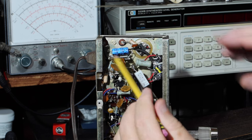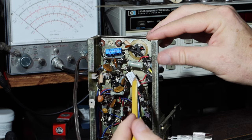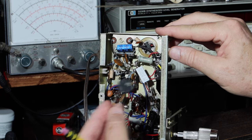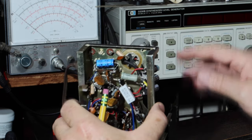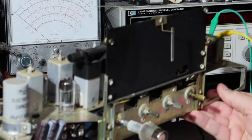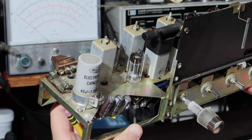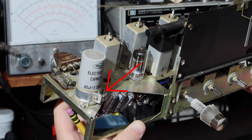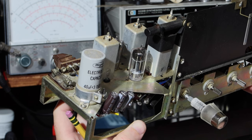Okay, and then this will end up being part of the line circuit. So let's ignore that for a minute. I want to go back to the neutral side. The neutral is going to come through, and I'm going to have to use a terminal lug strip somewhere, and I'll put in the thermistor, and then it'll go to chassis. All right, and I'll probably mount that lug up on top, where I have the new electrolytics. Probably what I'll do is use that screw that you see sticking up behind the old electrolytic and use that to tie down a new terminal strip to mount the thermistor on. The neutral will come into that, tie onto it, that'll give me a good strain relief, and then from there it'll go on to ground.